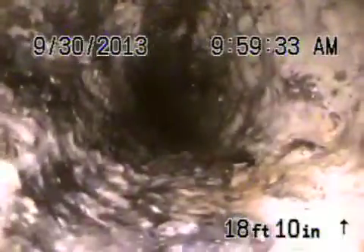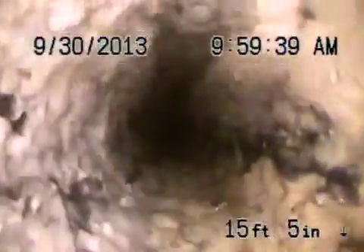So we're coming through the driveway. We should be coming underneath the house shortly here. That sludge buildup is common in cast-iron pipe. You can see it's got a little bit of sludge buildup, but what I'll do is I'll throw the jetter in. Once we're here doing the repair, I'll clean that all out.